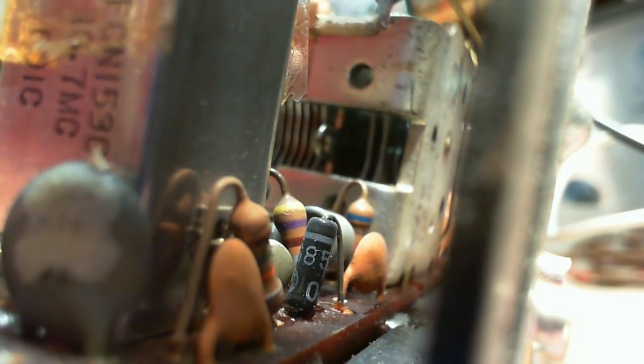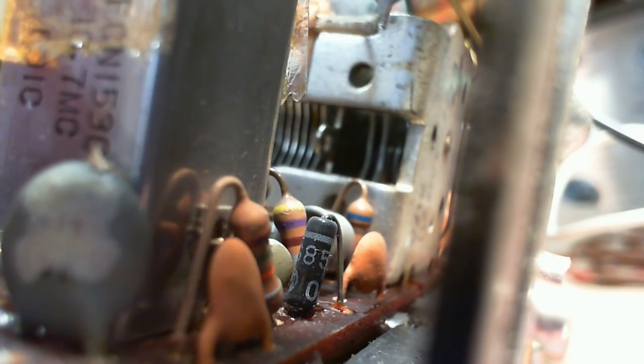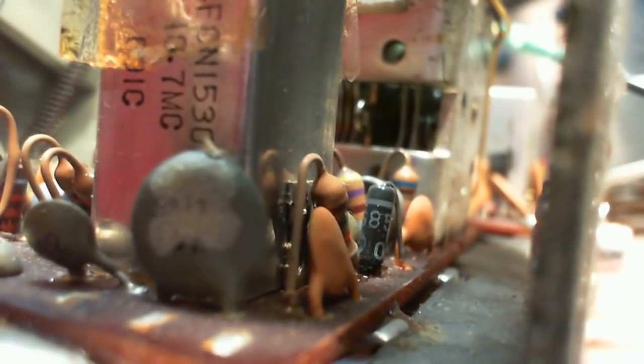There's a diode right there, that black thing. Kind of an unusual looking diode. I tested all those. Based on my test, they're okay. Now, why can't I find the 22K resistor? What's going wrong here? Looking again where that's supposed to be. It's definitely 22K R5, right beside a big coil. Well, that's probably the problem. The 22K resistor is missing entirely from the circuit. How about that?